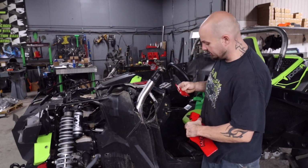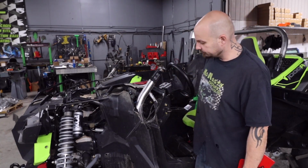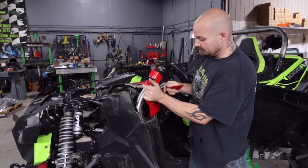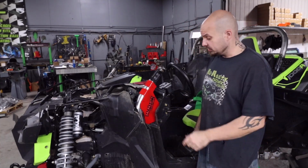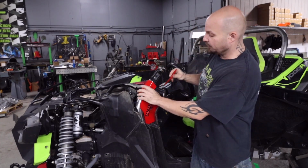And this bracket here, it's notched out for the frame rail, the 1-inch tube. Beautiful. And she just goes right in the back side right there, and that's that. So like I said, you simply take this, it'll be raw metal, slap it on, that's it, that thing's in place. Just weld this thing all the way around, then you come in from the back, you can hold it with your hands, tack it, and then you can weld this at a 45.